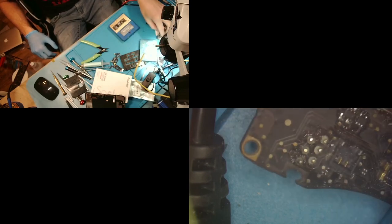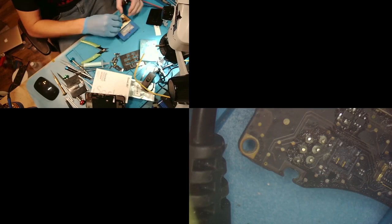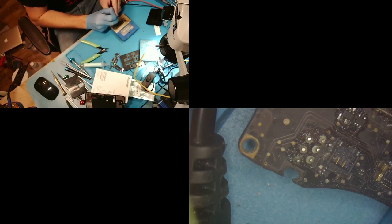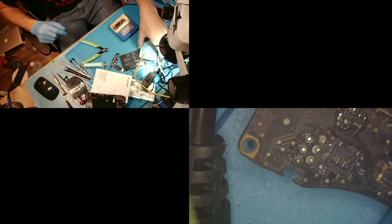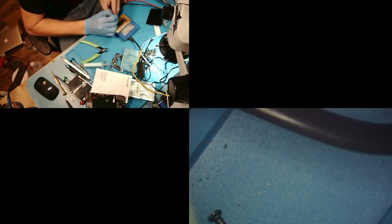So what we're going to do is make sure the board is cool when we start this, like it's not hot, okay? And we're going to do the alignment first, so we're just going to make sure everything is aligned while the board's cool. We're going to use our tweezers. Make sure that's aligned. All right, now we're going to heat and wait. Oh, that came on the line because I tipped the board heater.